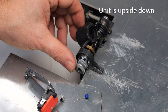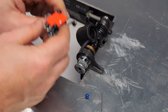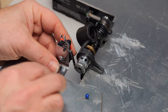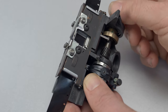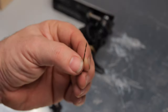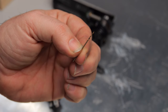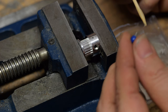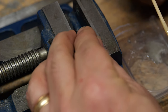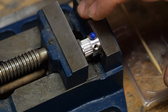This is a timing pulley that I attached to the end of the film gate, and I'll use this to activate a momentary contact switch. When this pulley rotates to a particular point, this pin will strike the momentary contact switch and the camera will be activated to take a photograph of the frame in the gate. This is the tiny drill bit that I'm going to use to drill a hole in the pulley. After I put that tiny hole in, I use my favorite fixer-upper epoxy and glued the pin into the pulley — we'll let that dry overnight. Maybe I'll clean my fingernails too.